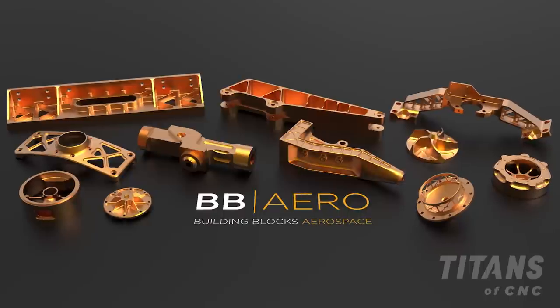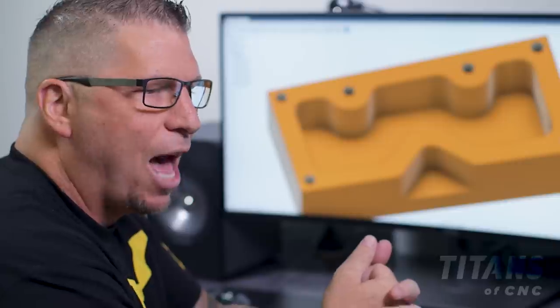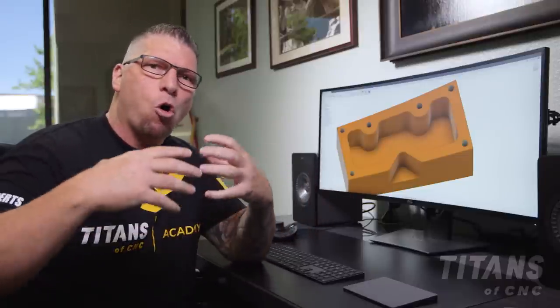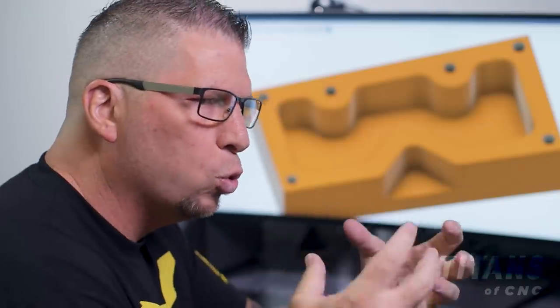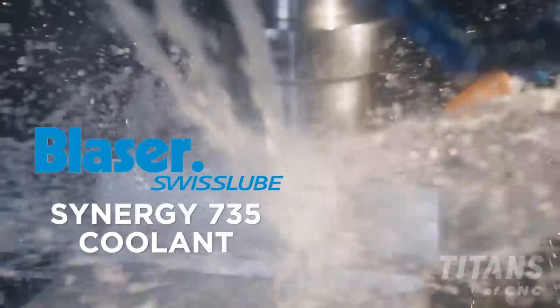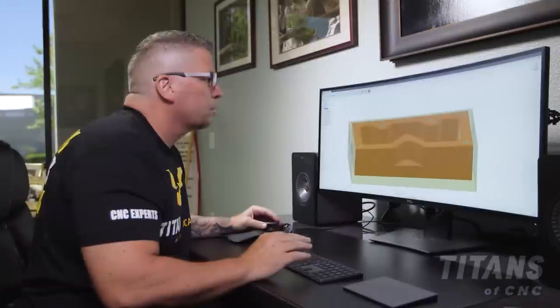Running Inconel is not easy — it doesn't cut like butter. It's a hard material, so you have to upgrade your tools. When you step up to titanium, Inconel, Monel, 15-5, and harder materials you need a different tool and a different approach. When cutting a material with a high nickel content, the cooling and lubricity all come into play — cooling can literally make you or break you.